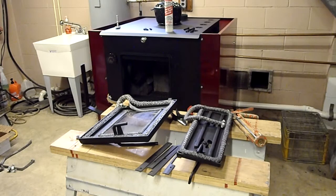The other thing we want to concentrate on is gases. Any exhaust, we want to keep in the stove, in the stove pipe and into the chimney, not having any gases leak into your home. That's why it's recommended to install not just a smoke detector, but also a carbon monoxide alarm detector in your home, especially when burning wood.